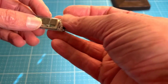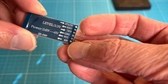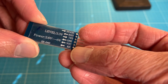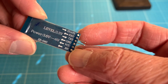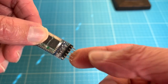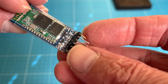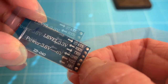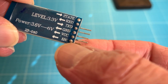This is my NERD HC06 with the extra pin that I added. The reason I did that is the EN pin on the HC05 does come into play when using the AT command set. But as you'll see, we can just use the standard four pins because with the HC06, it automatically starts and allows you to enter AT commands — unlike the HC05, where you have to press a button or put three volts on the EN pin.